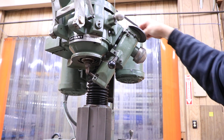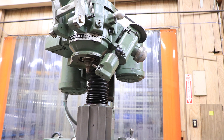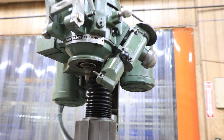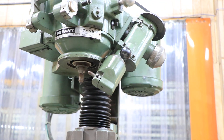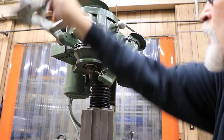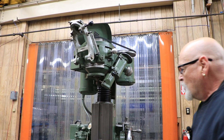That wobble is part of the secret of this machine. When you're not using the dresser, you can kick it up out of the way. When I go into the grinding mode, now we get our up-and-down reciprocation and we also get the planetary movement. This option here is used for locating your center — it swings down underneath there and helps you easily get your centers located.